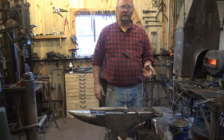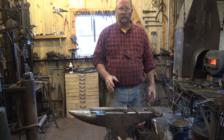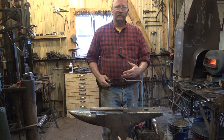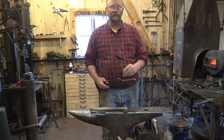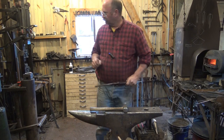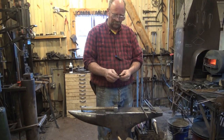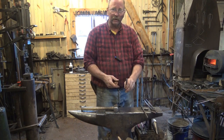A leaf like this really needs very few specialized tools. It can be done mostly at the anvil with a hammer. You'll need tongs at some point. I'm using a short piece of bar because I had some just laying around, but if you leave it long enough to work and hold the bar in your hand, you can do most of this before you cut it off. You'll need a small chisel — we've covered making hot chisels, this is a smaller version, about 4 inches long with a nicely curved edge. This one I'll use under the treadle hammer. If you're going to use it by hand at the anvil, make it a little longer so you can keep your hands away from the heat.